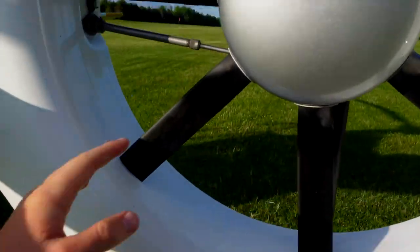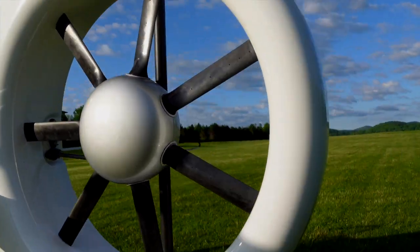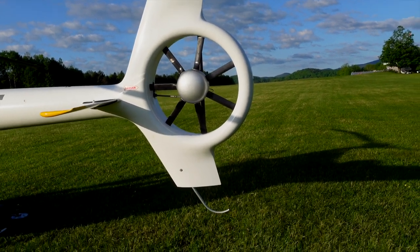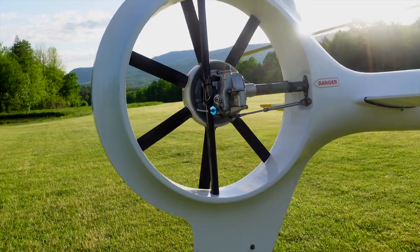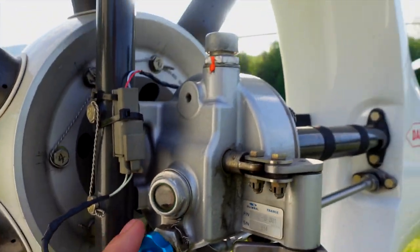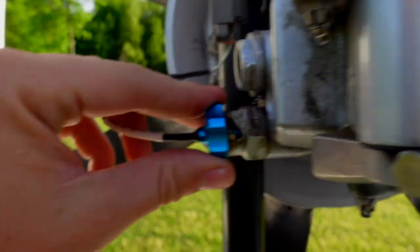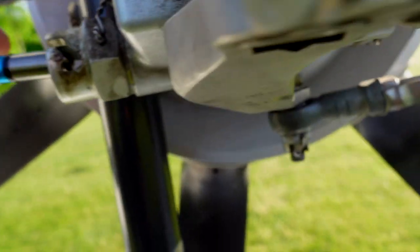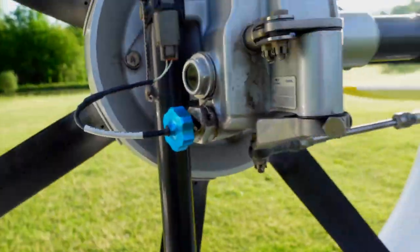Horizontal stabilizer, fin from tail rotor. Now some people say you don't have as great tail rotor authority — I haven't experienced that at all. I've felt like I've had everything I've needed. It is a really big fin, so you can get into some weird LTE tail fin stall situations, but it's worked great for me. One thing that I really like that was new to me: this blue thing — this is our tail rotor gearbox, how we shift directions of the axes. But this is our chip detector. So if something in the tail rotor gearbox chips off and breaks, you pull this out and check your chip detector to see if there are any particles on it. Pretty awesome — and oil doesn't start flowing out, so you can check that real quick.